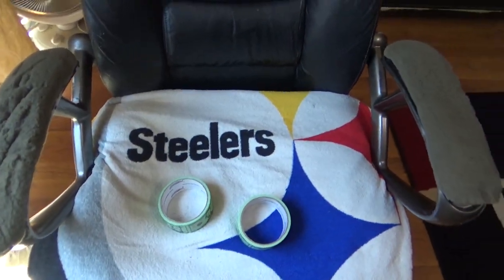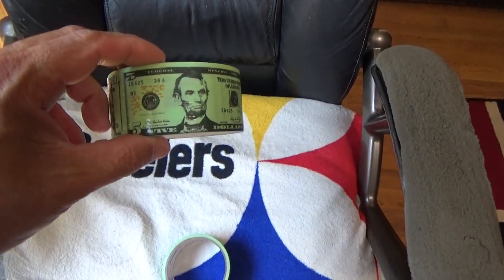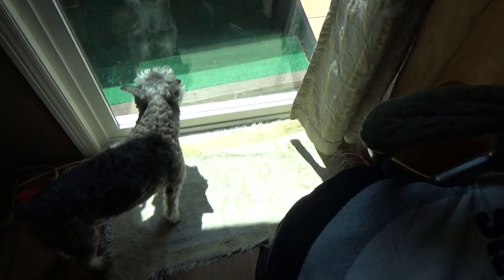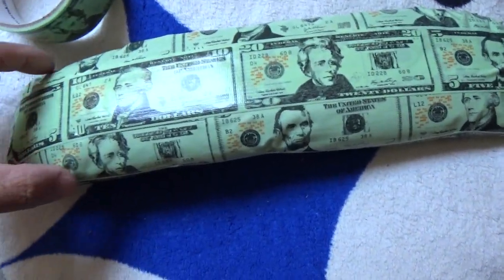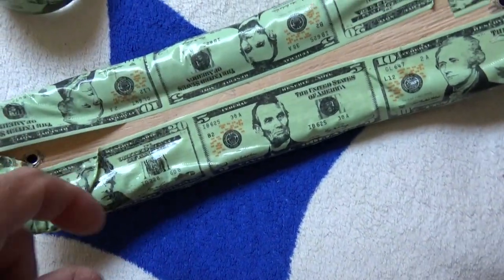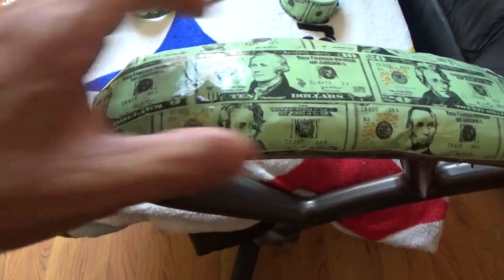The chair is still pretty good. I'm just going to tape these up and then put the screws back in, so we'll see how this turns out. Easy project today, short video. Look, I got everybody watching me — I got her, I got him. I got one side done. This is before and this is after. What I did is I put two strips down the side and one down the middle and folded these over. Normally you would staple the material here, but this is going to be held down when I bolt it back down.